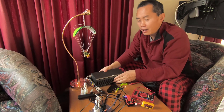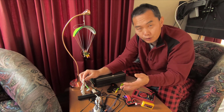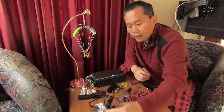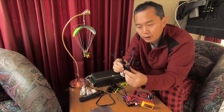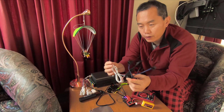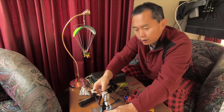That's the common speed controller for the motor. Whenever you want to build an electric winch, I have a module that can give 0 to 5 volts to control the throttle. On my receiver side, instead of linking a servo to control the throttle, I have this little USB module that gives a signal from 0 to 5 volts, powered by a USB power bank.